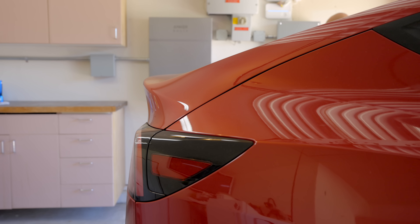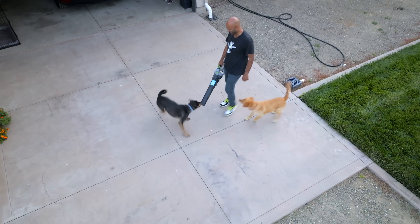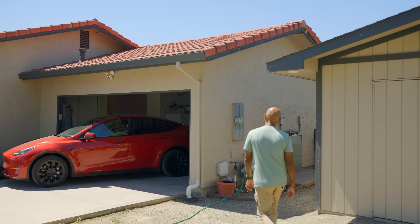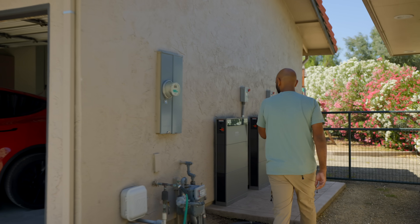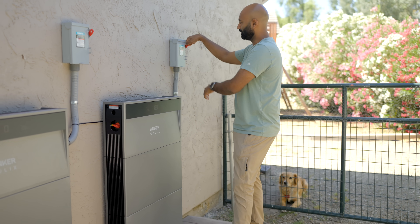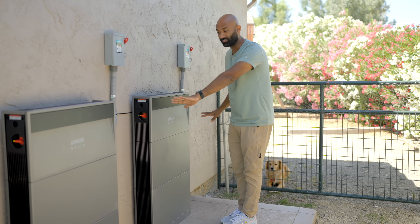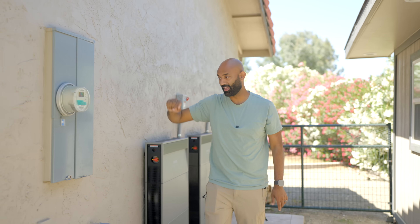In the future, maybe they add an electric car, more heat pumps, or something else. They could just add battery storage — up to six power modules with six batteries each for a total of 180 kilowatt hours. So expandability and future-proofing: check. There are also disconnects you can turn off, so if there was a fire, firefighters could just isolate the batteries. All of this feeds into a backup controller installed on the inside of the house.